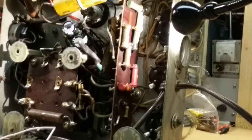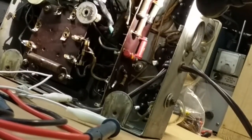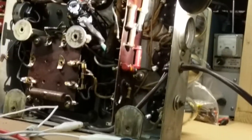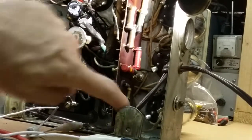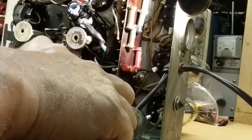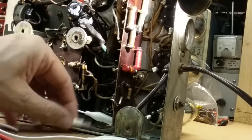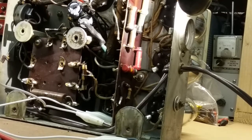And then can you see this bottom one? Bring it down a little bit more, I think you can see it. Maybe not. Oh, sorry about that. Lock it in here. You might not be able to see that because of the angle. There's one here, and I can't tilt the camera that angle. So let me check it. It's orange, black, red, so it would be 3K ohm. And it's reading nothing because my alligator clip came off. 3.8. So it's bad. It can't be over 3600. It's 3800, so it's got to be changed.